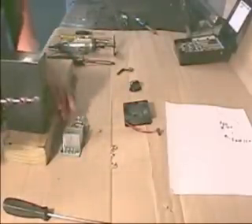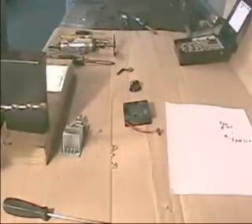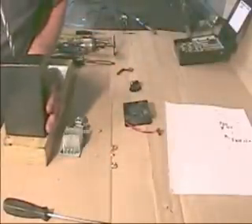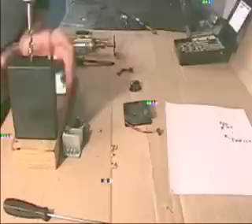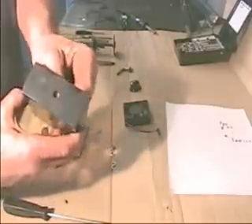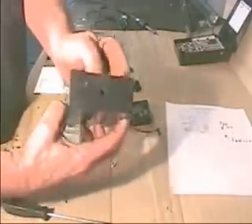You can put it on top of a board. You should wear eye protection because we're going to be doing some grinding. We're going to drill right through this box. This is a 5/16 drill bit. We've got it on slow speed so that we can fit the pulse width modulator into that hole.